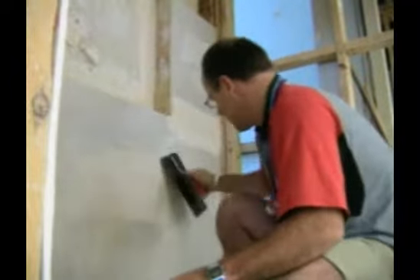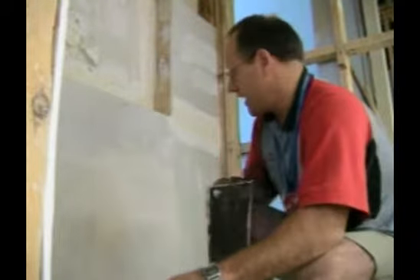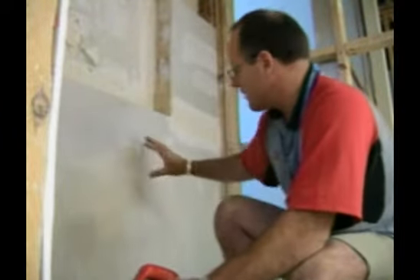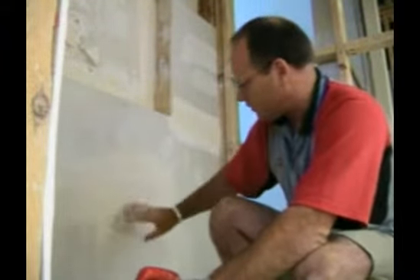And it's ready for sanding. That's how you repair a plasterboard hole — a hole in a plasterboard wall — covering a patch. The bigger the patch, the more it blends in, without going crazy. As long as you've got it nice and feathered all around the edge, you can see that it dries evenly from a nice light tone through to a more solid tone, and you can see that the tape has been completely hidden.